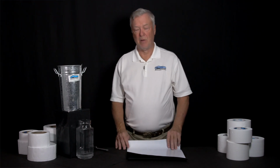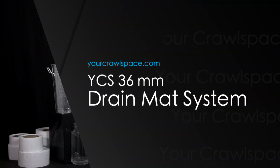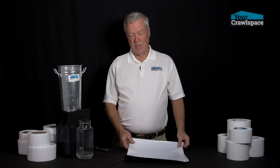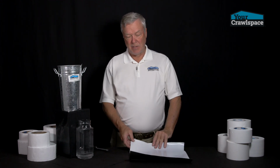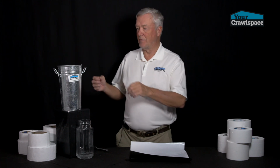Okay, today we're going to go over the 36 mil premium drain mat system. We developed this a number of years ago and have been working on allowing water to move through the fibers, the hydrophobic fibers on the back of the product. The design here is to use in wet spaces and very rough areas. The felt on the back resists puncture, but it also is hydrophobic and moves water.